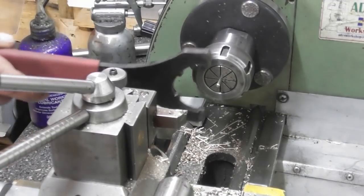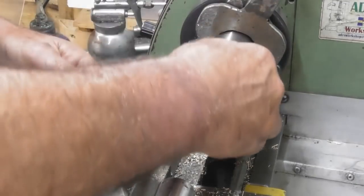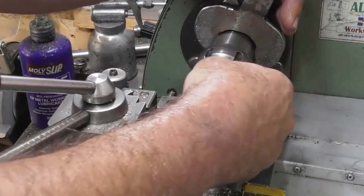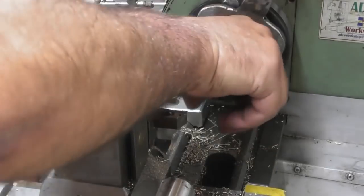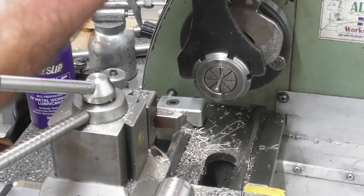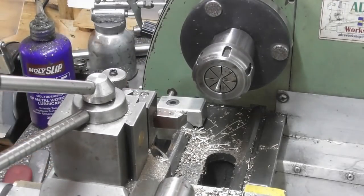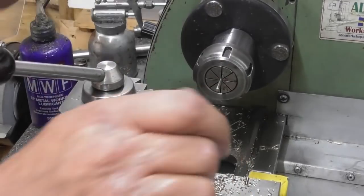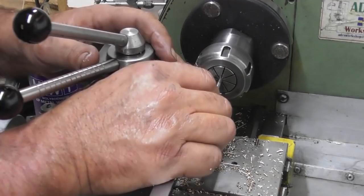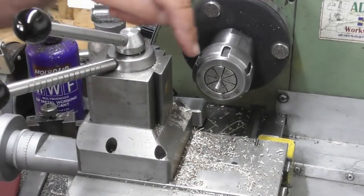And we'll pull her out in the chuck a bit more and run the die down there. I'm sure you've seen me run a die down a piece of stock so many times by now. Stuck out a bit, where you can see what's going on. Okay. So I want 5/16 of thread on here. So, yeah, good 5/16 on there. No worries. So, back out again, turn it round.